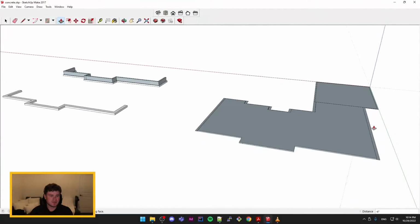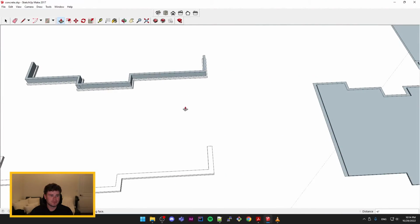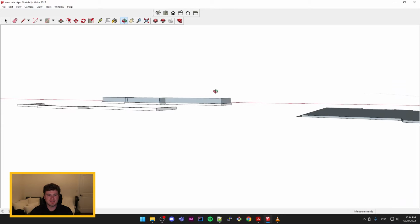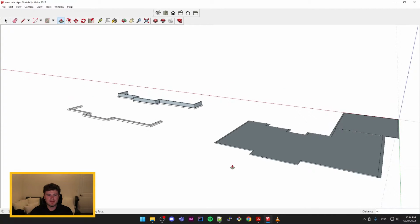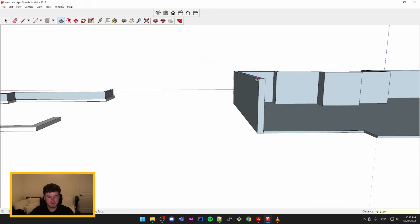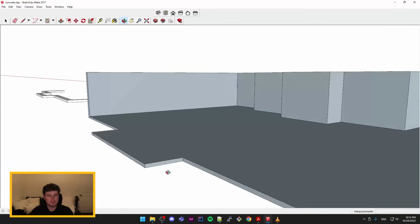The slab is going to butt up here to what we already poured. So the top of the foundation stem wall and the top of the slab are going to line up. And then the ICF, here I will raise this up to match 4 inches because the ICF is going to stand on top of the slab. And then it's going to be an 8-foot wall.